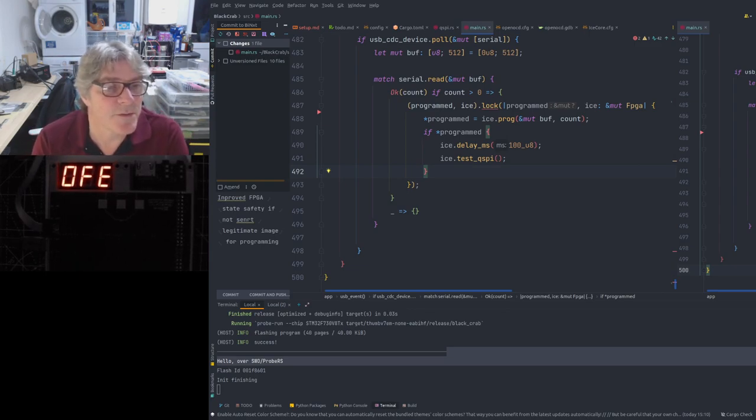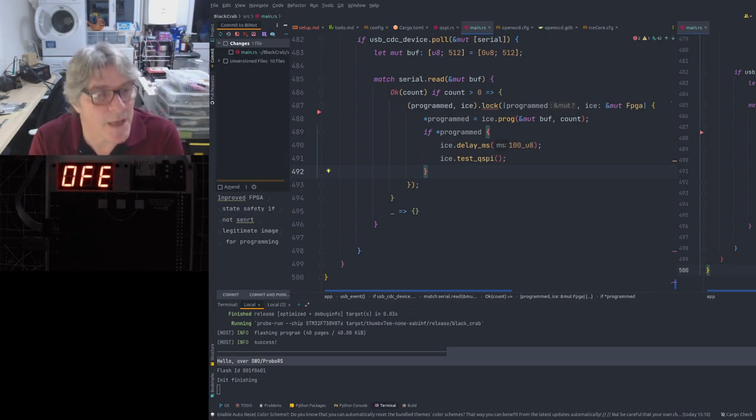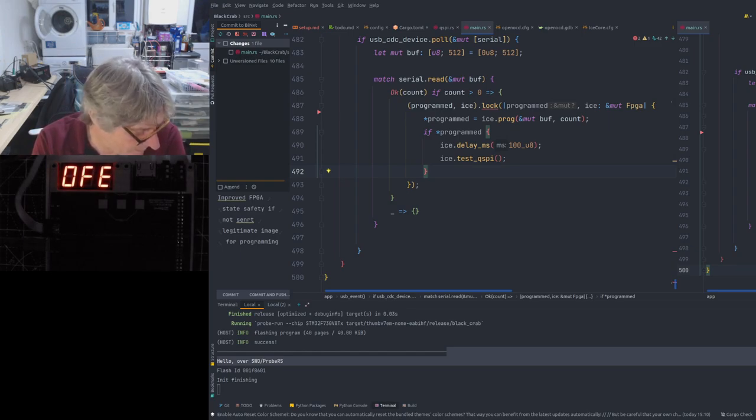I mean, there are things you can do as well. You could do a multi-Ethernet tile, putting a switch chip on. Is it a switch chip? You can get chips that have multiple RMII interfaces on them, and then you talk to them using RMII. That's another possibility, if you wanted multi Ethernet. You wouldn't want to use that for something like EtherCAT, and I'm not going to touch EtherCAT for some time, that's tricky, because of all of the intellectual property around it and licensing requirements.